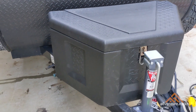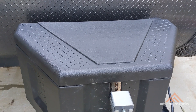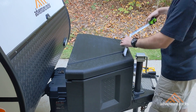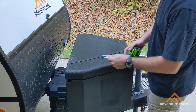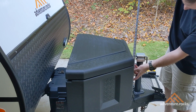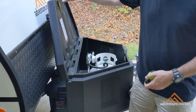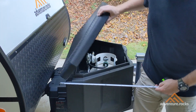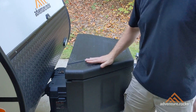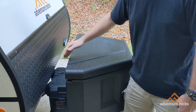There are a bunch of other similar boxes you can get as well. Here are the exterior dimensions for this one: 36 inches in the back, 18 inches in the front, 17 inches on the diagonal on either side, with a small section about four and a half inches, and the overall height of the box is 17 and a quarter inches. One other important consideration: when the box is open, the lid protrudes about another inch and a half to two inches as it hinges. If you push this box right up against something, you won't be able to open it, so give yourself clearance for that lid in the back.